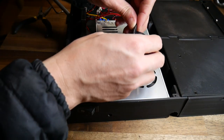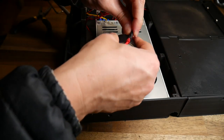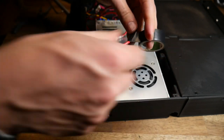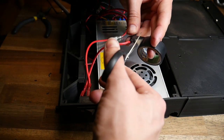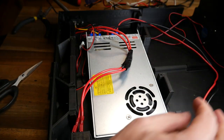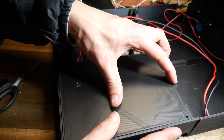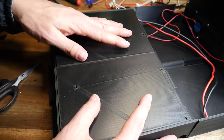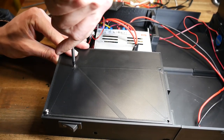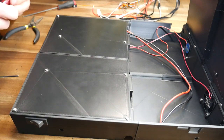Take the pair of wires that come out of the power supply to go into the mainboard, and feed them through into the right-hand side, then place your left-hand lid pieces to close up the power supply. These lid pieces, like the ones we've already done, are held in place with short M3 bolts — and once again, they'll cut their own thread as we insert them.